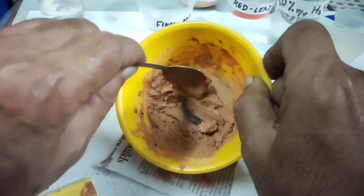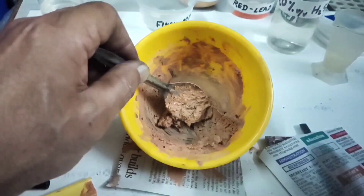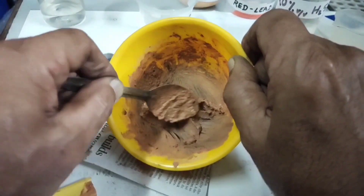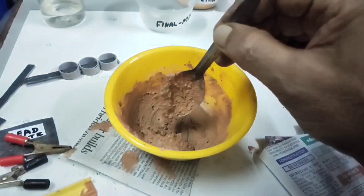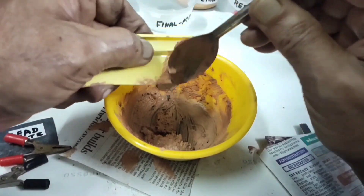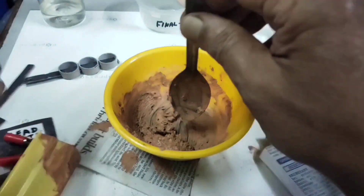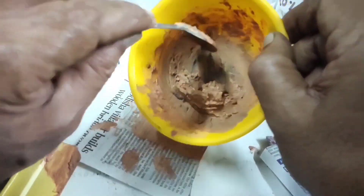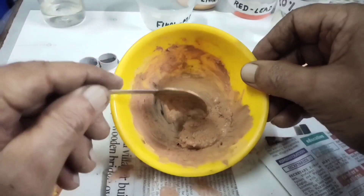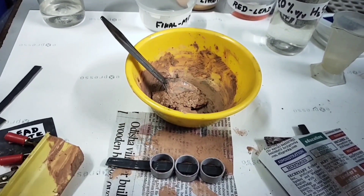The carbon will be dissolving slowly. The red color has now gone, turning a little black. This is why carbon is added — so that gassing of the negative plate will be easy. Carbon is added so that during battery operation, gassing occurs properly. If you add still more carbon, charging of the battery becomes very easy — carbon particles make it charge fast and increase capacity, acting like capacitors.